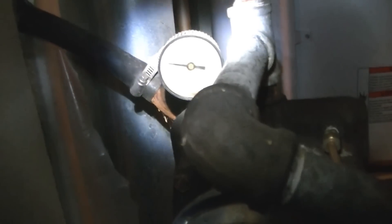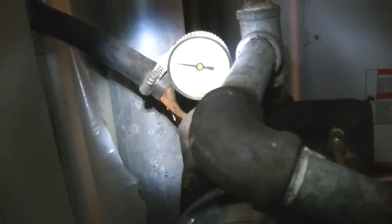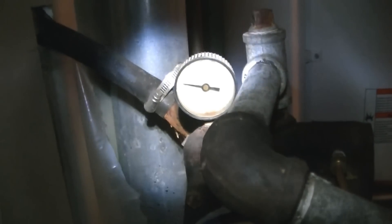I'm going to shut it off right there. We've got a switch — when we put that in, put it in backwards, so I marked 'off' on there. I don't want this to build up too much pressure again. I know the maximum pressure on this pump is 40 psi, so that's going to be my cutoff. Hopefully I can get it to turn on quicker so the pressure doesn't have to drop so far.